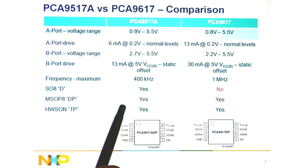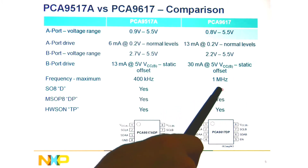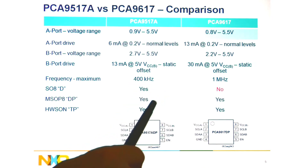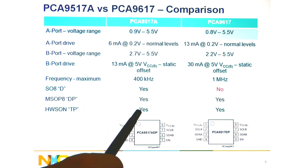The static offset remains on the B side. Frequency has gone from 400kHz to 1MHz. The pin-out is the same on the package. We don't do the SO8 package as there weren't many sales there. Most customers are going to the smaller MSOP or TSOP8 package, and we also have the HWS018, which is a small 2x3 package.